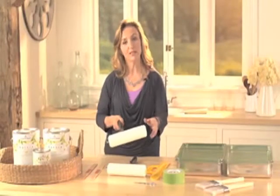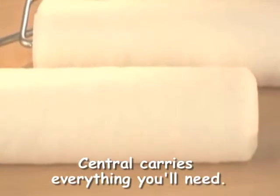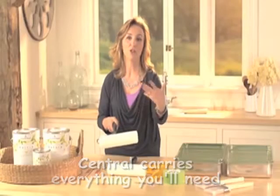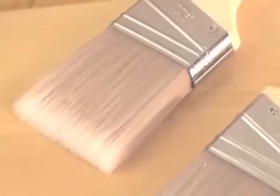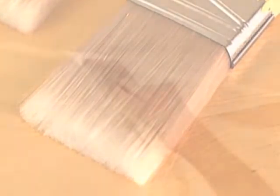Once you've picked your finish, you'll need quite a few tools. A good quality paint roller is very important — a three-eighths inch pile nap is perfect for either the eggshell or flat finish. Make sure it's good quality so the nap doesn't pull off into your finished paint job. You'll also need a good brush; a two-and-a-half inch angle sash is preferred as it's easier for cutting in and doing all the edging.